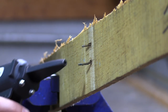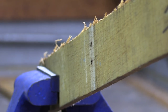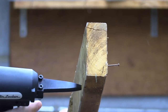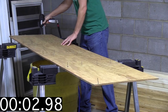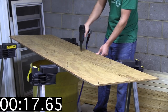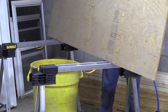Now unlike reclaiming wood by hand, where bent nails are typically a problem, you can simply slip the nose of the AirLocker over the nail, bend it straight, pull the trigger, and the bent nail is instantly removed. Here's a large piece of plywood with a lot of nails sticking out of it. With the timer running, let's see how fast we can completely clean this board up. As you can see, in just a matter of a few seconds we were able to knock the entire board out, and in under a minute this board is ready to go and be reused.